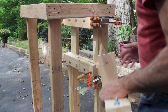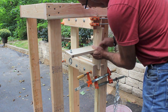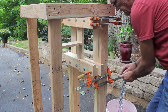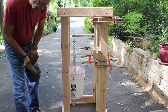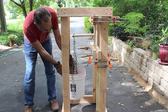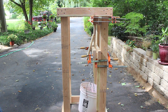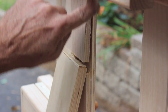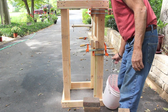Setting up now to do the three-eighths-inch shear test. We'll slide this sample in, up to the stops, attach the bucket, and start putting bricks in. Our last one — the quarter-inch — broke at 30 pounds, so let's see how this one does. That's unbelievable! It gave way at only 12 pounds plus the weight of the bucket, about three-and-a-half pounds. Amazing — it actually split the plywood along one of the plies in the process of tearing it out. That last one really surprised me.